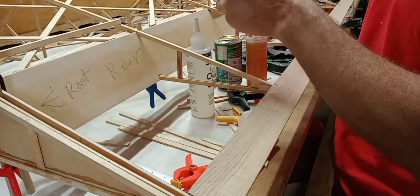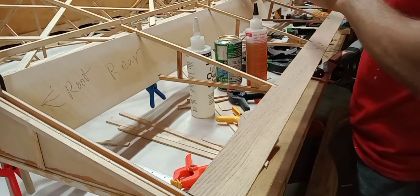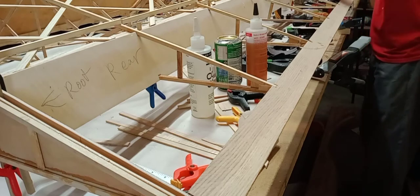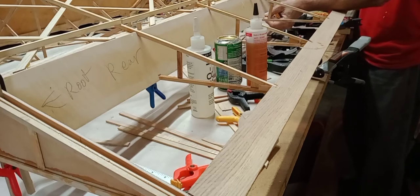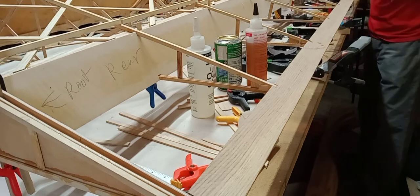I've got all these top spar caps fitted almost perfectly — they're all snug, so I guess that's about perfect. Now I've got to get them oriented right and set them up on top. We're going to start with the bottom. As we assemble it, we're going to have to hold everything together, have it pulled back, have it squared up, have these butt joints glued. The strength in these butt joints is going to come partly from the rib caps and partly from being covered with a one-inch wide strip. If we don't get that done right away, we'll have to sand off any glue in that area and then cap it. So I guess we're just about ready to start gluing now — and I'll fast forward that.